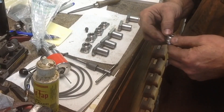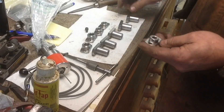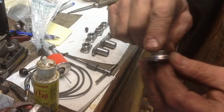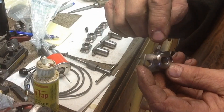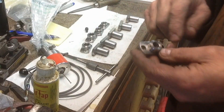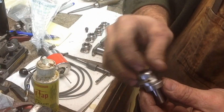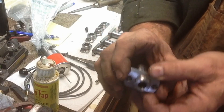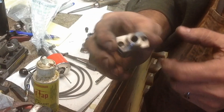I've got the main parts of the machining done, and I've done a rough deburr on this stuff. The only thing left to do is machine these flats here on the side, and then drill and tap the side of each of these heads for lock screws to hold tooling in. This one I've already machined the sides off of, and I've got to do the other four sets.